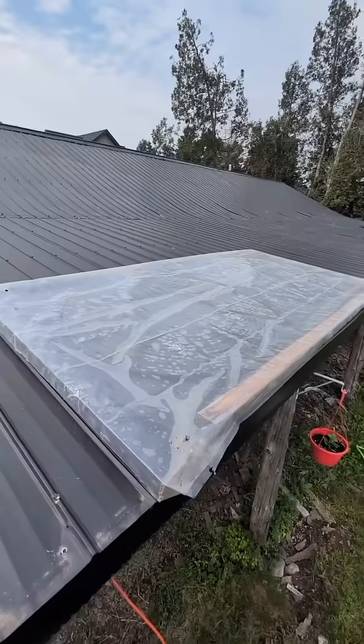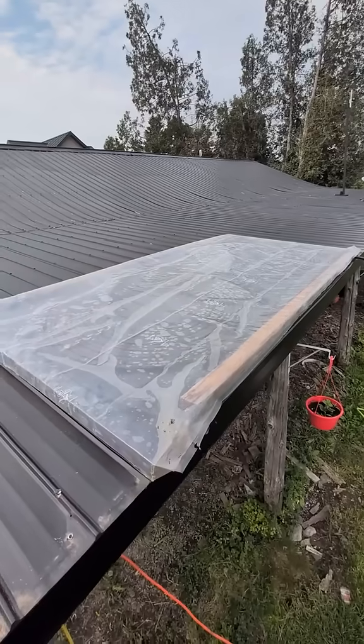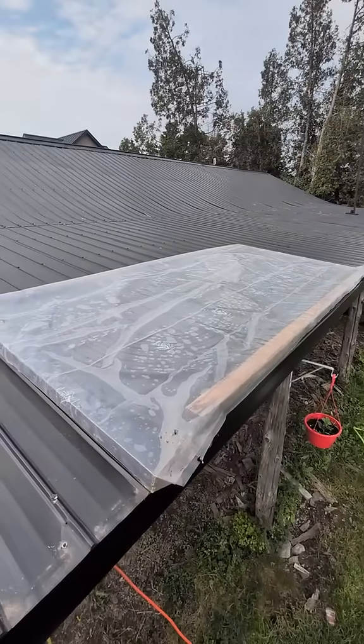Another one of the comments that I got a lot of is, why don't you just go solar? My pool gets so hot with solar. Well, I agree. Solar's fantastic, and I have one. Let me show you. I climb this ladder here, and there it is. It's on the roof here. There's 200 feet coiled up here. There's 100 feet coiled up here and 100 feet coiled there of black irrigation hose. It is on a black sheet of plywood on this black tin roof, and it's got clear poly over it to give it that greenhouse effect.